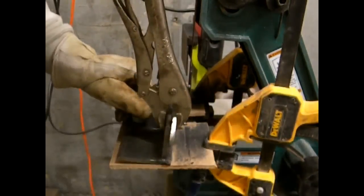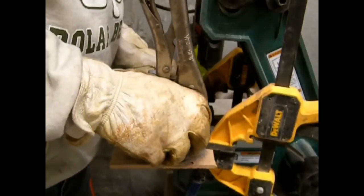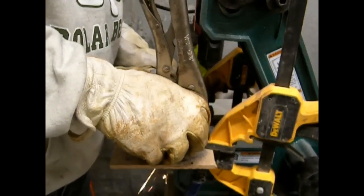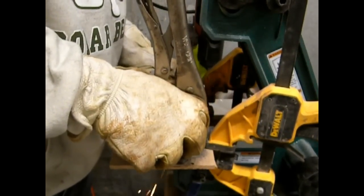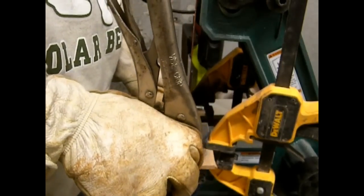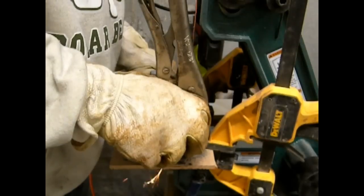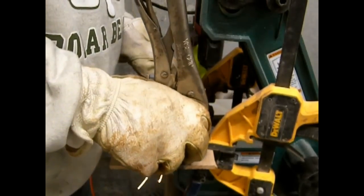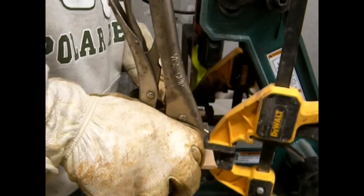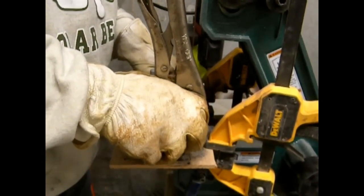Just as a demonstration, this is a 1-inch belt sander, and of course there's no guide or rails on the left or the right-hand side of the belt. So using a standard angle iron bevel jig, you can push in and then just drag the blade along the belt sander, and that creates a nice, even bevel along the entire length of the blade.